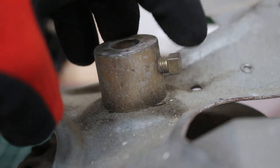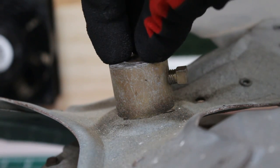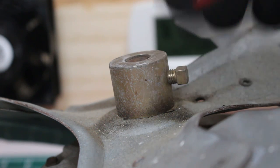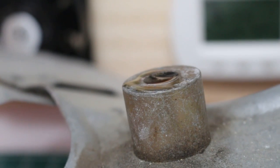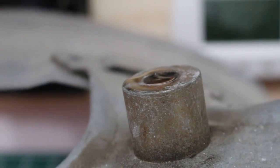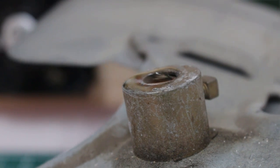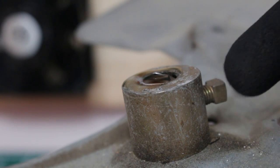As we can see we have a locking screw right here. Typically you would see the shaft sticking out of the motor a bit. In that case you're going to want to take some sandpaper and sand the rust off the shaft to make this as easy as possible. At the same time you can apply some sort of penetrating oil or WD-40. I did apply some lubricant — let's give that a few minutes and at the same time we're going to loosen our locking screw.